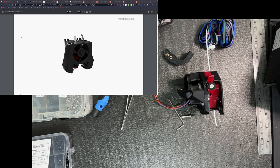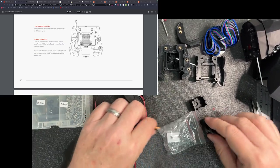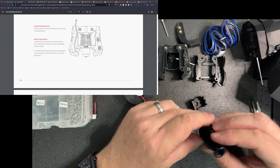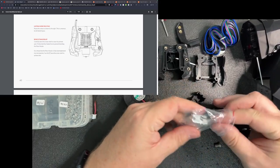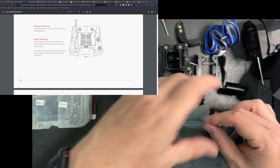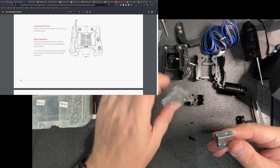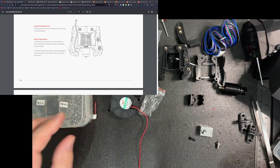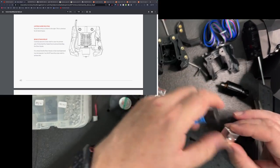So let's go down to our next step. For the next couple of steps, I'm actually putting together the hot end, so I need to get some more pieces. For this Stealth Burner, I'm going to do a V6 hot end. I don't have a high-speed hot end right now but I'm probably going to investigate getting one. I have a bi-metal heat break — I'll put that in. I have a grub screw right here, so I'm going to go ahead and start that so I don't lose it. The last thing I want to do is start losing that grub screw. I just got that started — that's good enough.